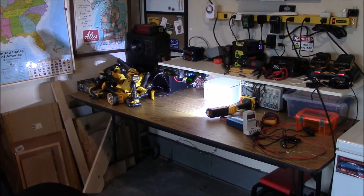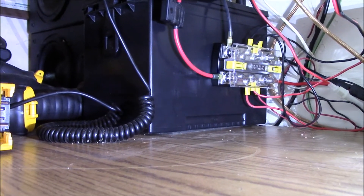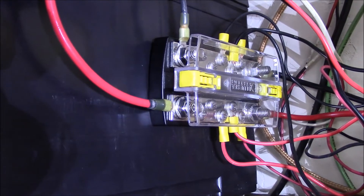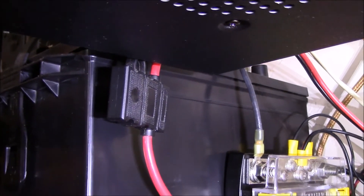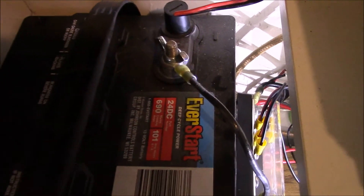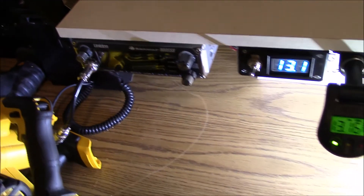I put a meter on my little bench top batteries. Check this out — got this Blue Sea Systems dual bus bar, a little mini thing, relatively cheap for Blue Sea Systems stuff. I had a whole bunch of DC stuff connected on top of the battery post and I didn't like it, so I researched and found this. Turned out pretty good. I just have one fuse protecting everything, wing-nutted on top with one wire — I think 10 gauge. Just something to do on rainy days.